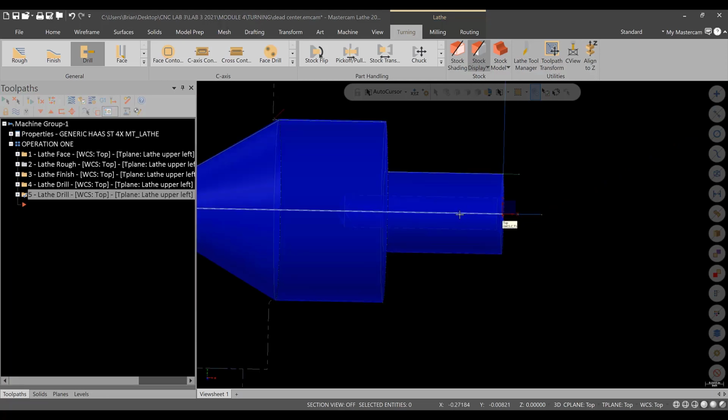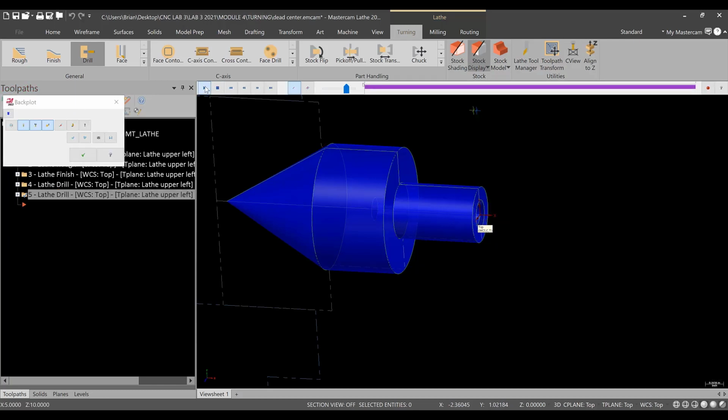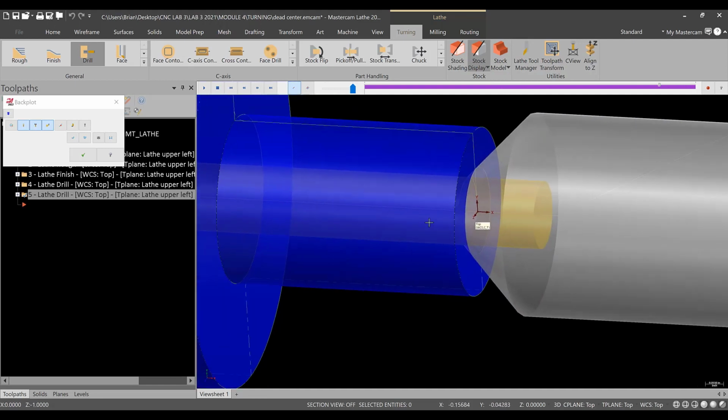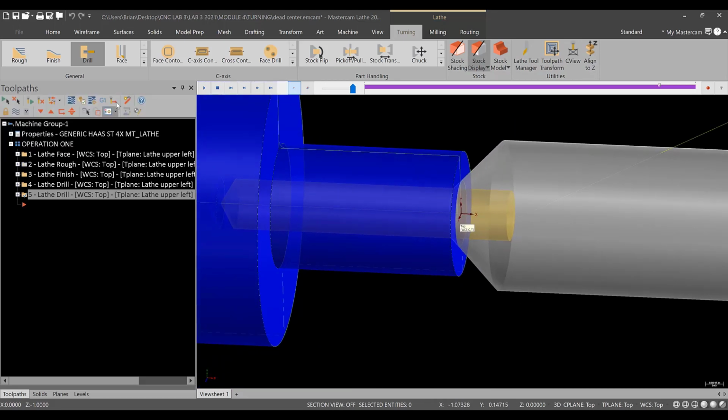But one thing you've got to watch out for is what the holder settings are in Mastercam. So again, we'll backplot this. It looks okay, even if I speed it up, and just hit back or forward. So I'm hitting forward now, S, and it goes back. You can see we have a holder issue right there. That would show up as a collision in verify.